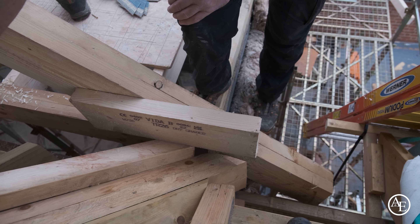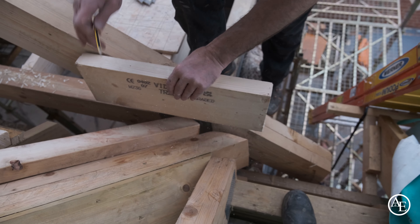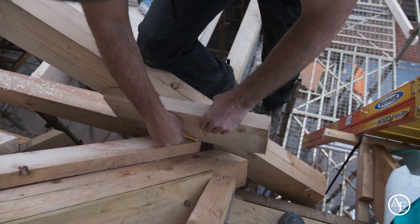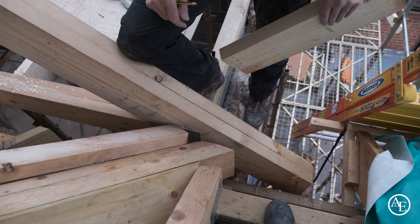What I've done here is I've run that timber down this line here, just going to use this bit of stock material, normal bit of material, place it in like that and then what I'll do is use a bit of this stock to mark the line and then that's just going to be a straight cut down on that angle.